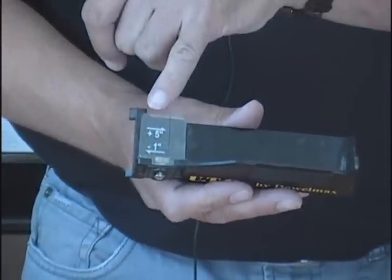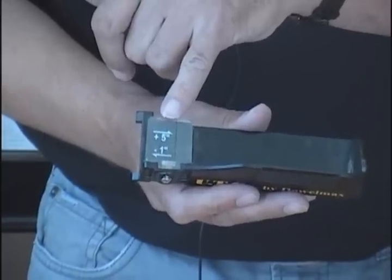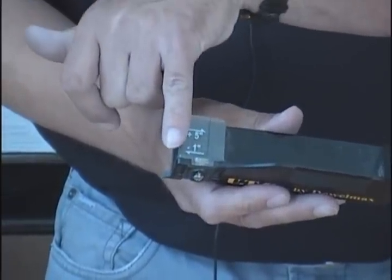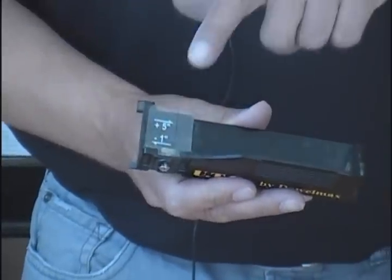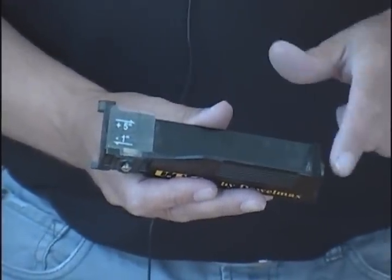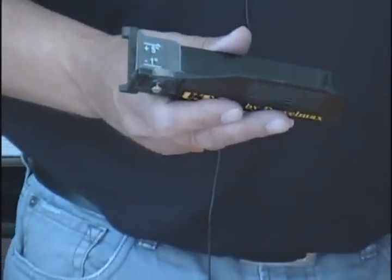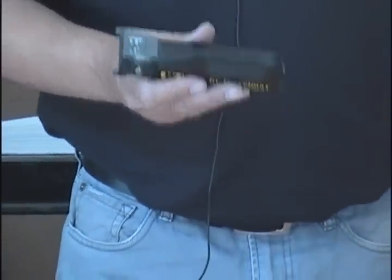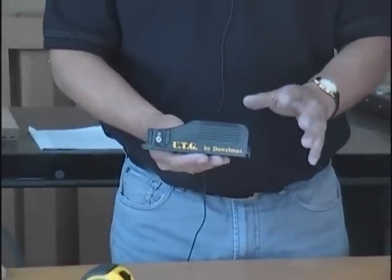The arrows on the lens indicate that five inches is added to the crosshair for an inside measurement and that one inch is subtracted from the crosshair for an outside measurement. By referencing the crosshair with the rear or forward stops and the tape hook in positive contact with the surfaces to be measured, the tape gauge provides a clear edge and accuracy in all measurement applications.